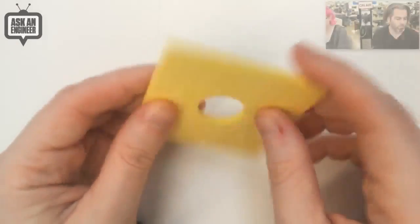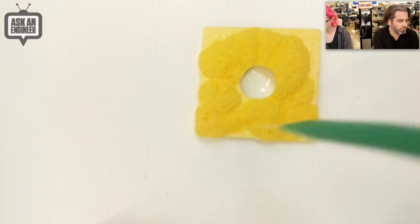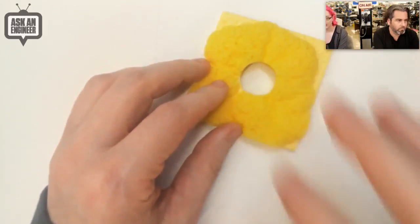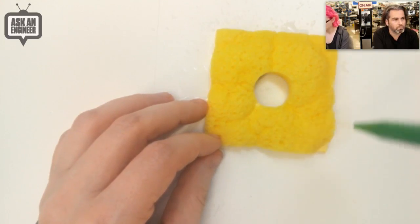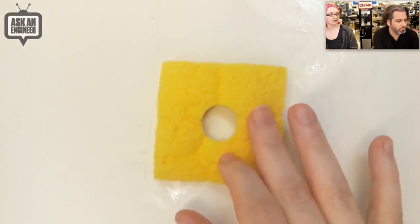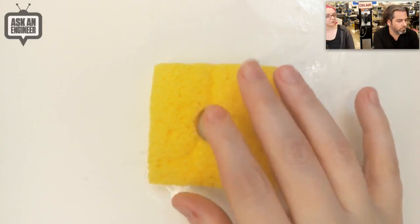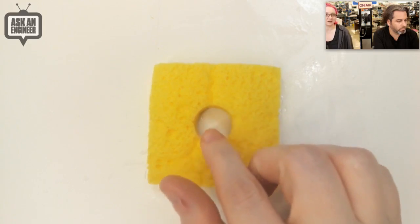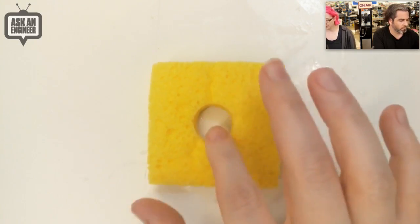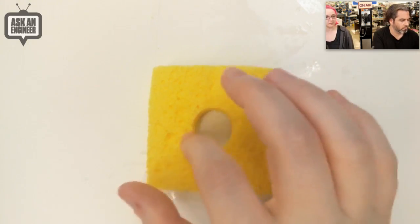You can cut out this hole. You can get it started by just putting some water on it — you don't want it to be soaking wet, but just kind of damp. And then when you brush your soldering iron against it, it'll clean off your iron. I prefer the sponges over the brass scrubber type. You can't use a kitchen sponge because it's not designed for high temperature. These work quite well — they clean off your iron very well. They have just enough texture to get little bits of old paste, flux, and solder off.